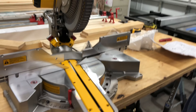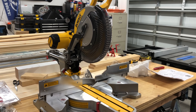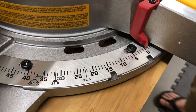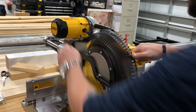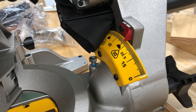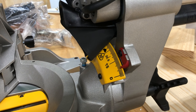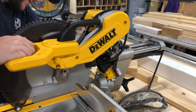It will lock back down. Once you get it all squared up and set up, if you realize it's not exactly where it needs to be - maybe a degree this way or half a degree that way - you can come down here and do some minor alignments by loosening these two screws and adjusting it that way. To get your double bevel feature, just come right back here, unscrew this and it will rock to wherever you want to go and then lock.